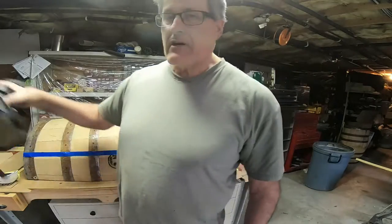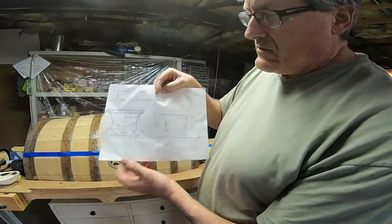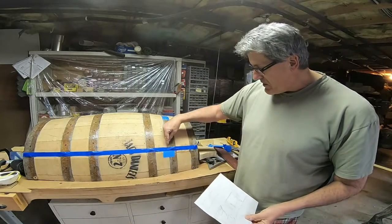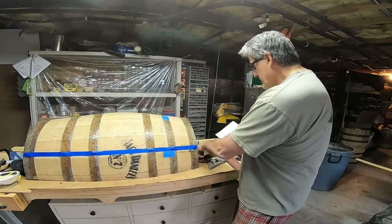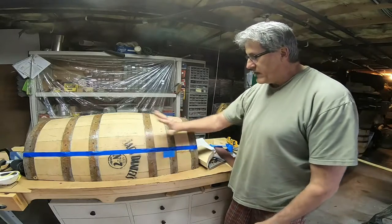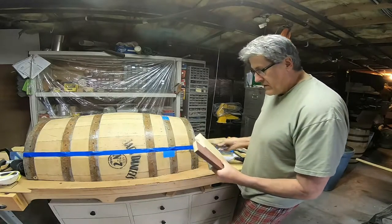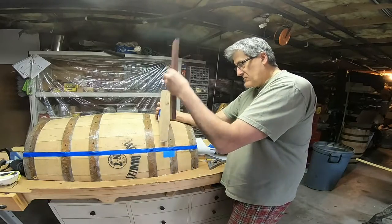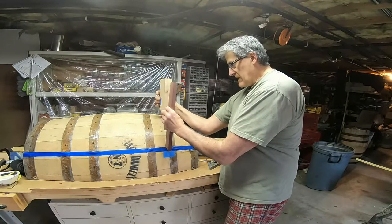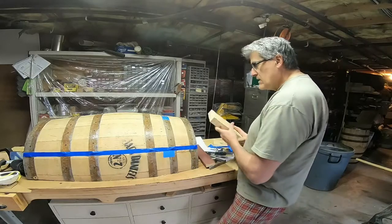So let me tell you where I am. Looking at making these upright legs — barrels upside down — and I've got an angle to deal with in two directions. I put a level on here and used it to simulate the edge. I used a scribe compass and ran it down along the level, and that's how I got that curve on the first one.